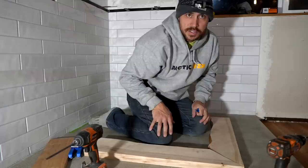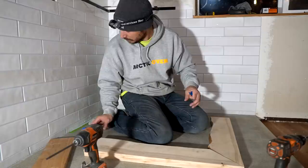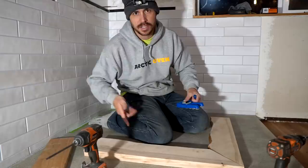This is our little birch shelf that we built. We had a regular store-bought lumber shelf there before, and we had this beautiful birch piece that we bought 4 years ago that we wanted to use. So we cut 45 degree angles on it. It's got a live edge, and we bought a pretty cool little tool that we're excited about, called a pocket hole jig. Usually I just stick my drill in a piece of wood and put it at an angle and try to get it the best I can, but we're gonna do it a little better this time.